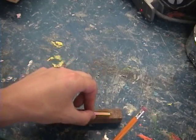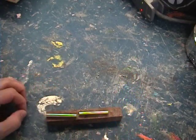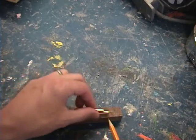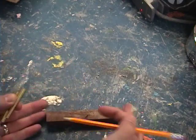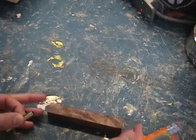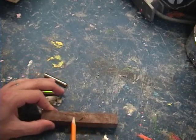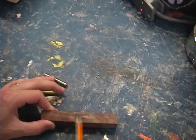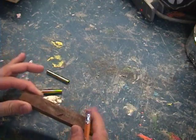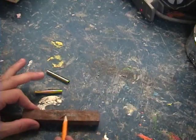and you want to make sure your pen blank is long enough. This one is plenty long. There's actually a little bit extra there. So what we want are two pieces of wood that are just barely longer than the tubes. Now, later on when we assemble the pen, we probably want to assemble it back together the same way that the wood was to begin with. That way we keep any patterns in the wood in line with each other. So one trick is to just make a mark in the center of the piece of wood so that later on when you go to assemble it on the lathe, you can line up that line and it'll keep everything the same.